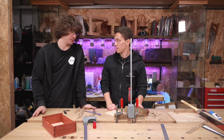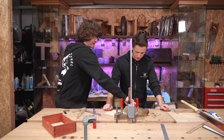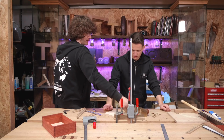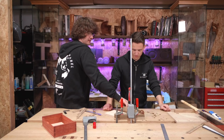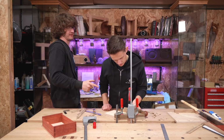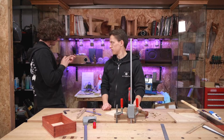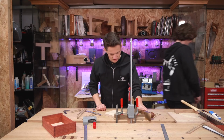Yeah. So what you could do is actually skew the blade slightly so it cuts heavier on the bottom side by lifting this up towards you. Okay. It should take a bit more now. You'll have to recenter the blade in there after you. Yes. But yeah, that'll certainly help. Okay. Get this out of my hand. That really hurts.